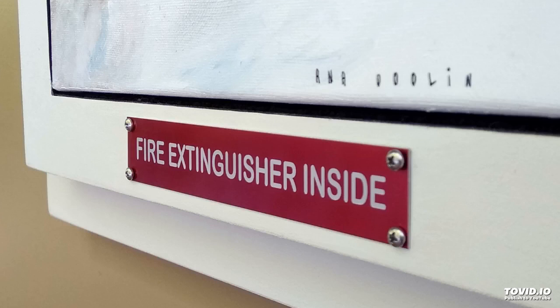Okay, it's time for the last cut now. Make sure you're right up against the stud. This panel will fall out at the end, so try to catch it. Try not to damage it, because in a worst-case scenario, say, for example, we find a plastic vent pipe in the wall inside of this opening, we can actually replace this cut panel, and with drywall tape and drywall mud, make it look like this opening never happened.